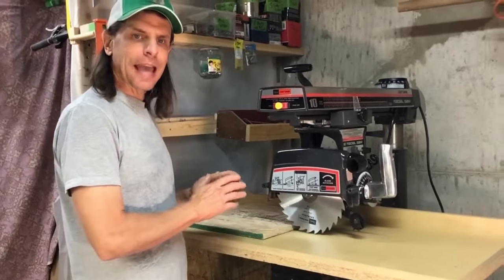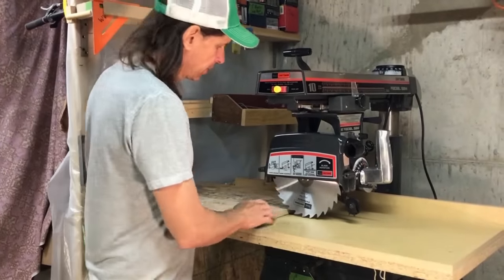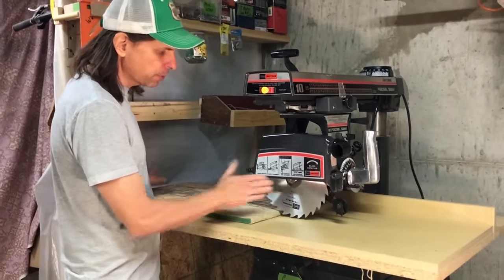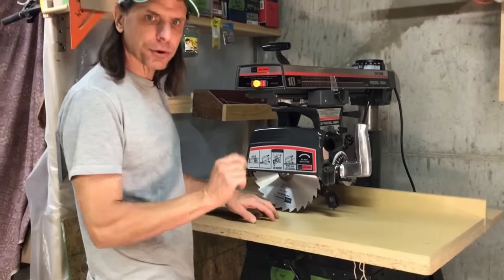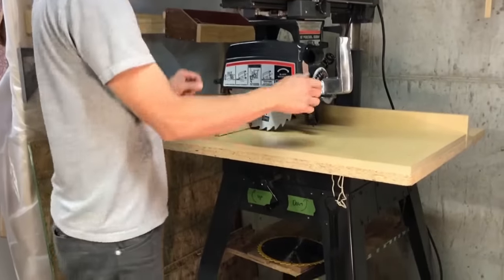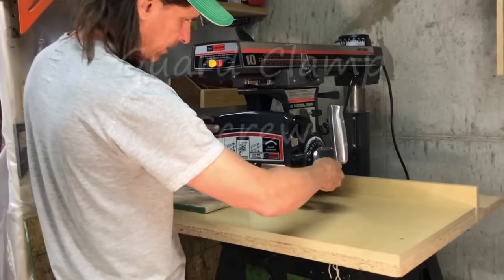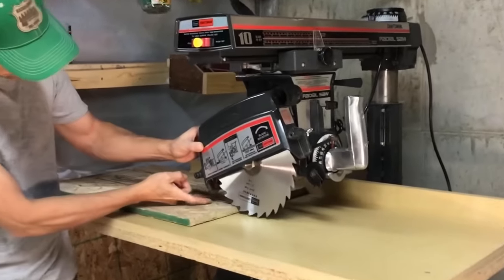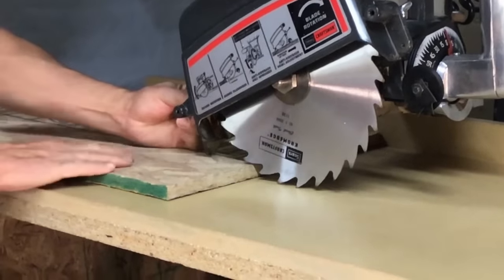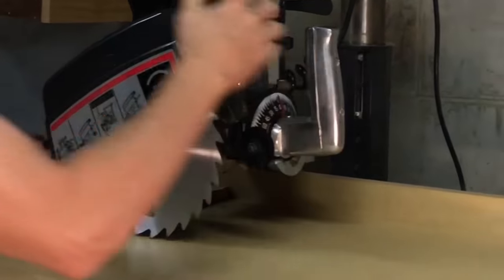I've repositioned the saw to the out-rip position, which is easier to see for demo purposes. Let's say we were ripping a sheet of OSB. First, I would position the blade slightly into the table — about 1/32nd of an inch — using the crank handle down here. Then I would loosen the guard screw, take the nose of the guard, and lower it down so it's just about an eighth of an inch above the piece I'm cutting. Then I'd tighten it up to secure that guard in place.